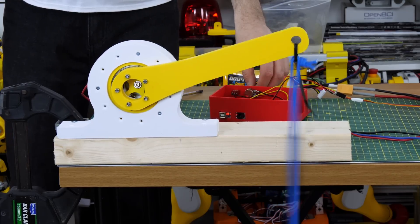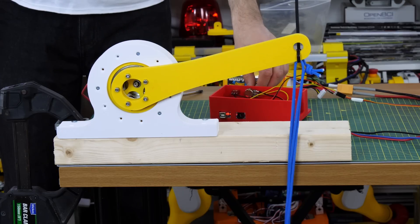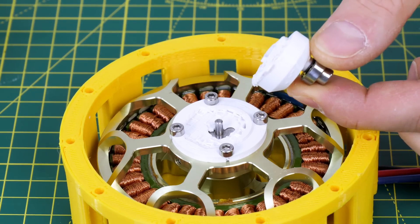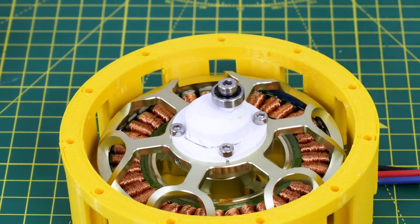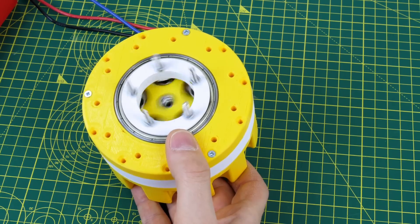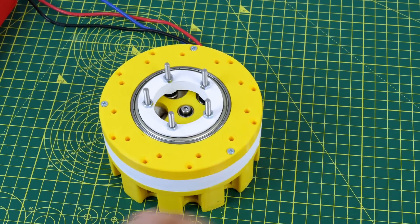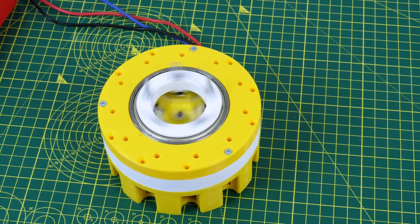However, in testing the first version, which looked like it was working pretty well, we found a number of issues. In fact, the gearbox broke on one of the first tests lifting some mass — the cam on the motor which makes that cycloidal disc spin off-center completely snapped through. That gearbox only had one cycloidal disc, so with the off-center cam and off-center disc, it made the whole gearbox wobble and vibrate quite a lot.